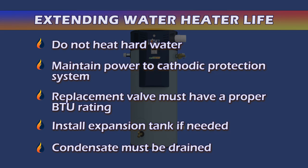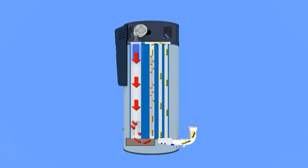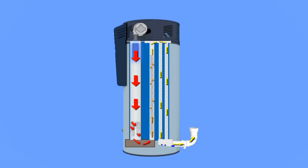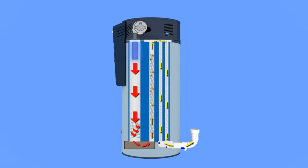Finally, the OptiTherm is a high-efficiency gas water heater and produces condensate which needs to be drained. A supplied condensate trap is installed in the exhaust vent, and an optional condensate trap can be installed in the intake to prevent condensate from collecting in the vent or entering the burner.